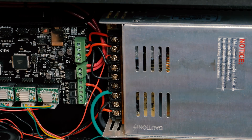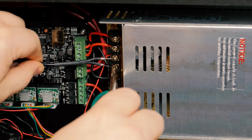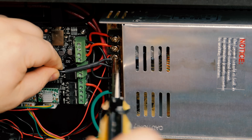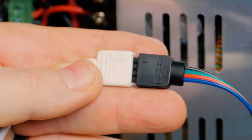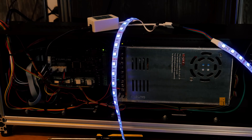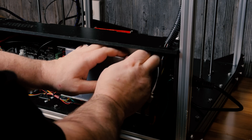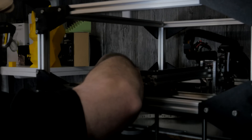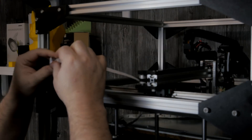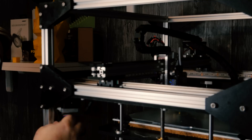Power off the machine and unplug it from the wall or directly from the power supply. Put the wire you made under the appropriate screws on the power supply. Plug the other end into the controller box. Take an LED strip, plug it into the controller box, then power up the printer. Test that the LEDs work and then turn it all back off. Measure the distance from the white plug on the controller box up to the point you want to attach the lights — for the FT5 I ran it up the back extrusion and came out by one of the Y-axis motors, which was 16 inches. Stick the LED strip on the frame lining it up so the end will plug into the wire you made.